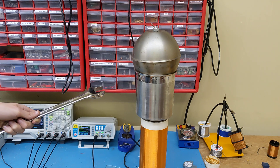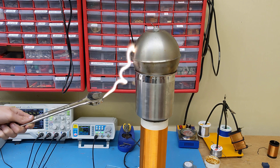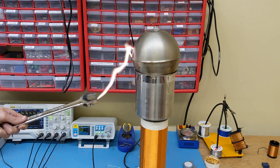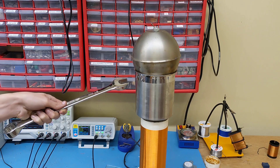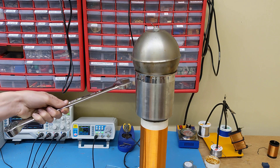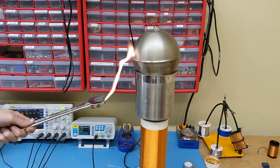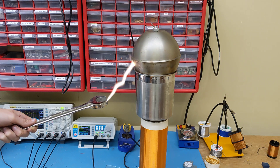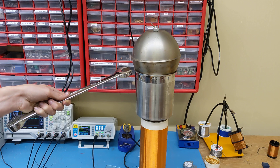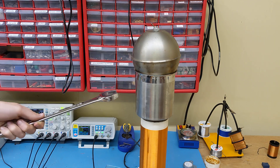So that's when the other power supply kicks in. But they're both going into hiccup mode. Hiccup mode is when the power supply detects an over-current and shuts off for a length of time — it's to prevent the power supply from overheating. However, in our case, it's detrimental; it's reducing the performance of this coil.